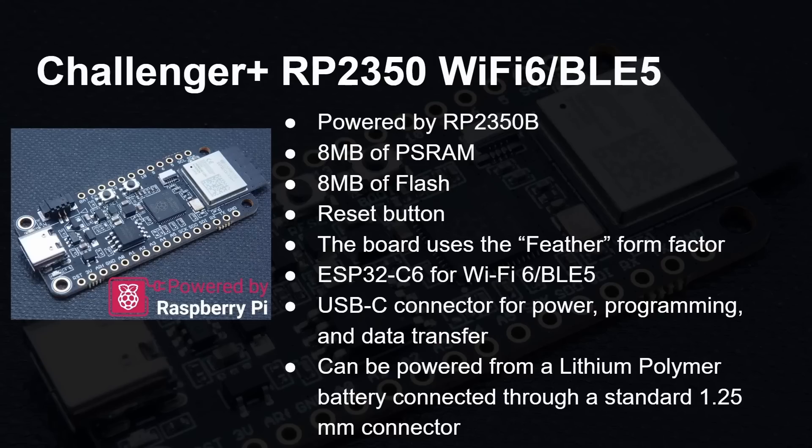For those making embedded projects, the board can also use a lithium ion battery. There's circuitry for charging built into the board — you just plug it in, put it in a case, charge it up, and then use it until the battery needs recharging. The battery connector is built in from day one, though not the battery cell itself.